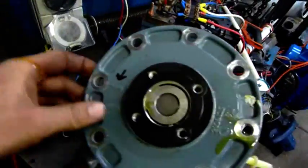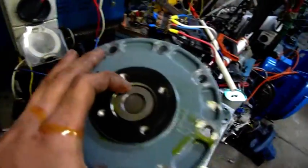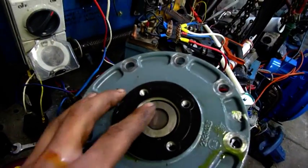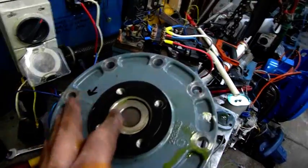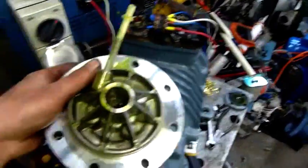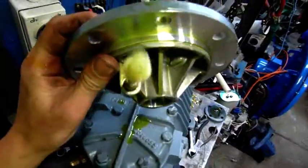The main reason I believe the pump is bi-directional is because of that little thing there. At the moment it's running counterclockwise from the compressor end, but this piece just seems to rotate either way. If I change direction it'll spin around and again we get oil spewing out everywhere. So the bi-directional pump — it's kind of interesting. Donaldson bits have the same type of pump in them, probably not, but either way that's pretty cool.